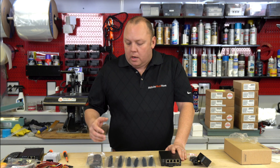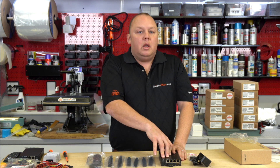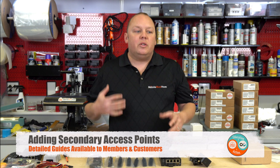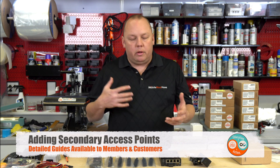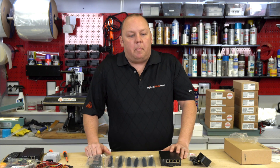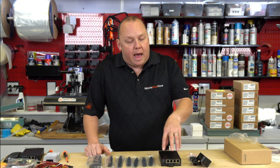This modem, just like the Duo, has an included Wi-Fi controller which can control external access points. The challenge with the Duo predecessor was that it didn't have Power over Ethernet, or the ability to power an external access point — you needed to run power to that access point with a PoE injector or a 12-volt power supply. They've added PoE support to the Transit Pro E, which is a nice touch.